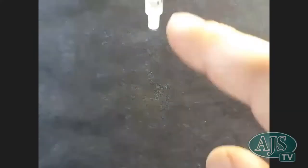This little guy here is the tip of a syringe, and you can't see the plumbing, but I've got a very sophisticated setup that goes up to a soft drink bottle with water in it, and a little tap from some trickle irrigation that lets me turn on the dripper. Because I'm cutting glass, I don't want to be breathing glass dust, and I don't want to wear out my diamond, which will get quite warm as I cut. Using the water as lubrication makes my diamond burrs last longer. It also cuts down all the glass dust, so everything sticks down to the surface and I can clean it up nice and safely later on.